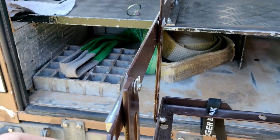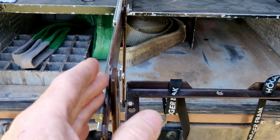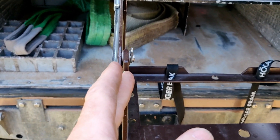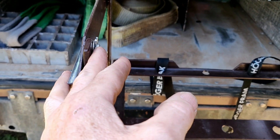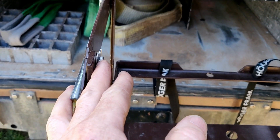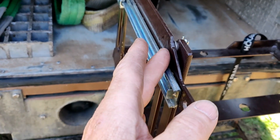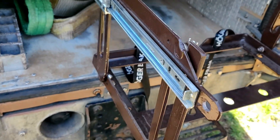For the clevis pin, to get the measurements right, the easiest way was to build everything up and layer it. I started with the side plate, put a washer in, then put the drop arm, then the other washer, and marked it and drilled a 2mm hole. Once I drilled the hole and put everything together, I cut the head off, reamed the 8mm hole a little bit, and then welded it all together.